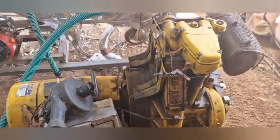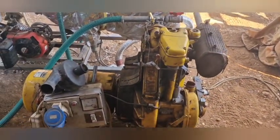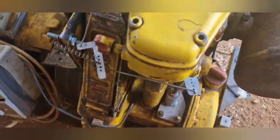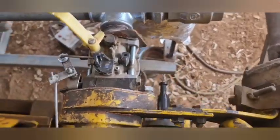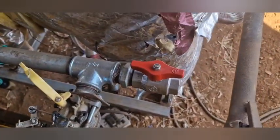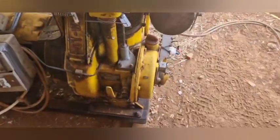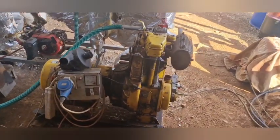I'd be happy with five kilowatts because that's about what you can get from this engine — it's an 8.5 kVA unit, so about seven kilowatts real output. You get a derating of 20% when you switch to producer gas. This is a modified diesel engine with a governor, a carburetor for 14 horsepower, and a mixing valve. I estimate this thing can get five kilowatts, which will be more than enough for most people.